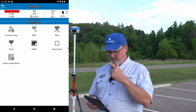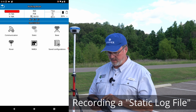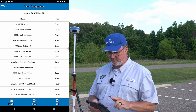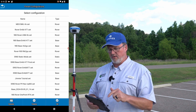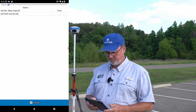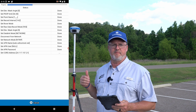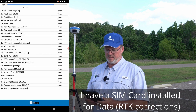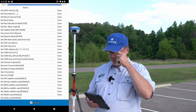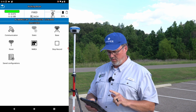I'm going to stop the recording since it was logging a file. Now I'm going to go into my saved configurations and go into rover mode using the Mississippi RTK network. I'll hit OK — it's going to kick over, put it in rover mode, and I'll be getting RTK from the state of Mississippi. Instead of being in single mode it should go into RTK mode and in quick order go to a fix — and yes, we've got a fix.